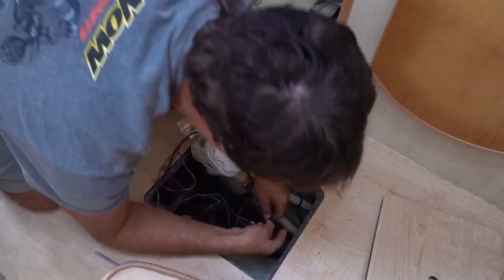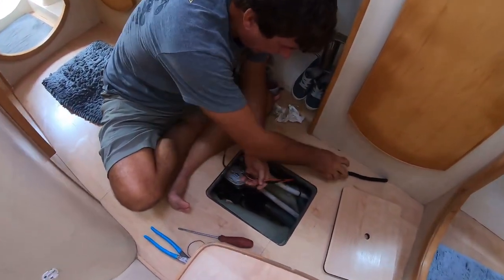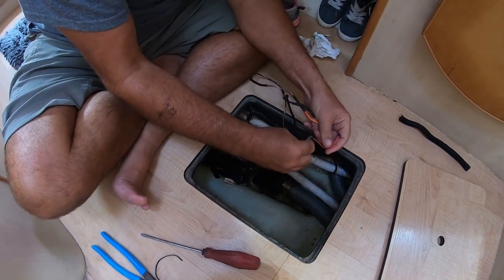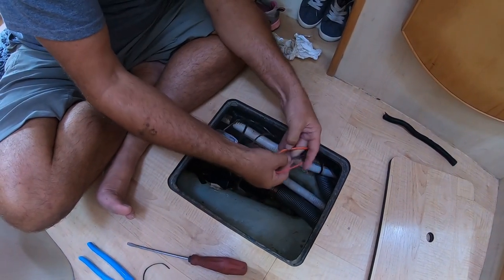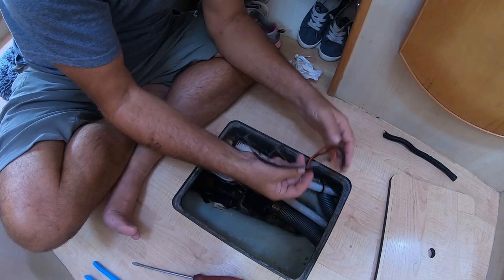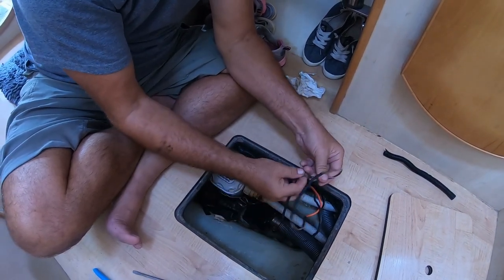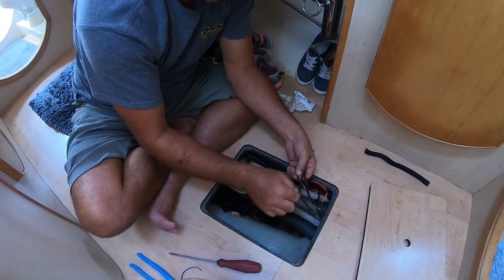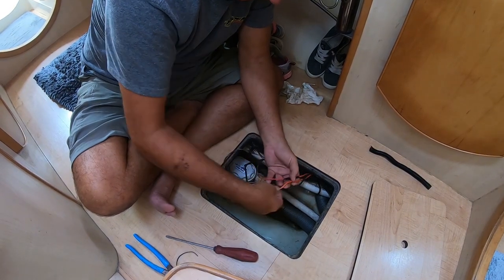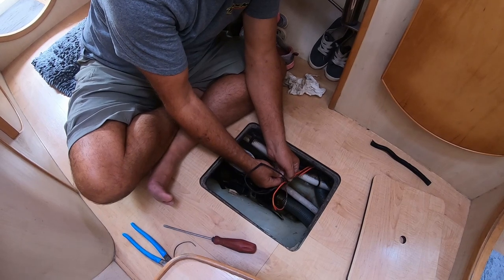The connections are solder sealed and therefore theoretically waterproof. I swear this whole boat is held together with zip ties. So here's what we're dealing with — this was over top of these wires, so I hadn't seen these connections before. This seems okay, but that does not. Look at that — there's probably a broken wire or a bad connection there. This wire here — not bad there — but this shrink wrap over the top is not water tight, that's just shrink wrap. And look, the wires are just knotted together. So that's all going to be cut off. These are the connections I did that are water tight — solder seal connection. This one's broken. Solder seal is not ideal for in here; it should be crimped and sealed. We're going to take them all back to here and connect it up.